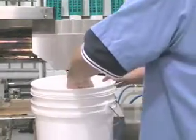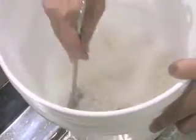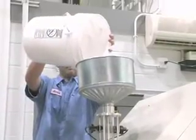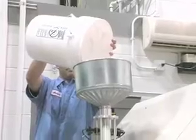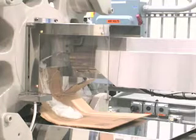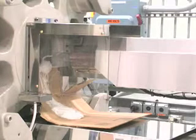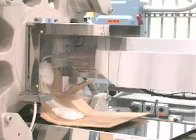Mix PDQ thoroughly with the new resin. Then pour the mixture into the hopper or add directly into the barrel. PDQ utilizes a mechanical cleaning process, therefore no soak time is required. Simply add the PDQ resin mixture to the machine and run the mixture through the barrel and nozzle. You may notice steam rising out of the barrel. This is normal when using PDQ liquid purging compound.